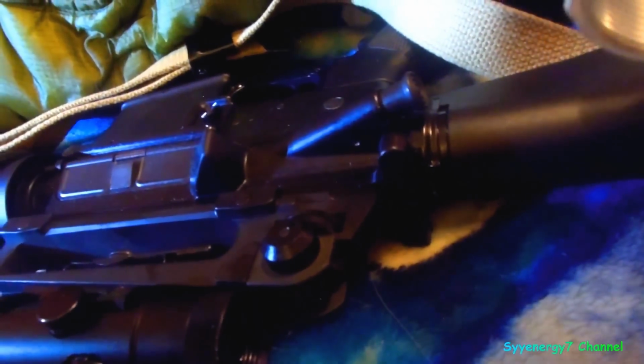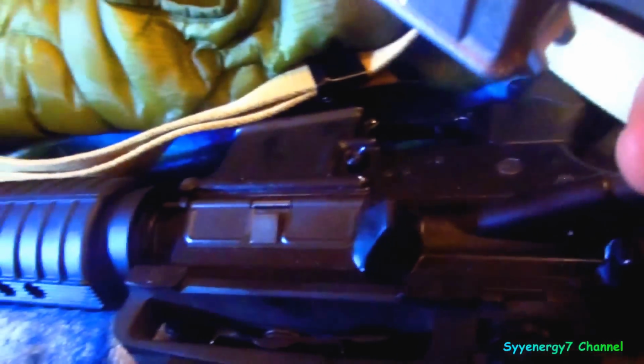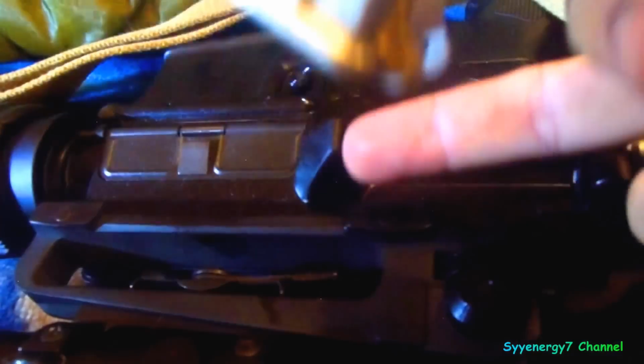Because what happens, I think the paint gets in there, the epoxy gets in there, and I think they're machined a little bit tight because people complained about the uppers being kind of loose on the lowers, and so then you got the pins so damn tight. So what the hell are you going to do? I really don't give a damn about the thing flopping around a little bit on the top. It really doesn't change the accuracy at all, because the sighting system is all connected to your upper. I'd actually rather have these kind of loose, but that's how they manufacture them now because people were saying it fits so sloppy, and it's kind of like GQ stuff. But yeah, that's another wrap.